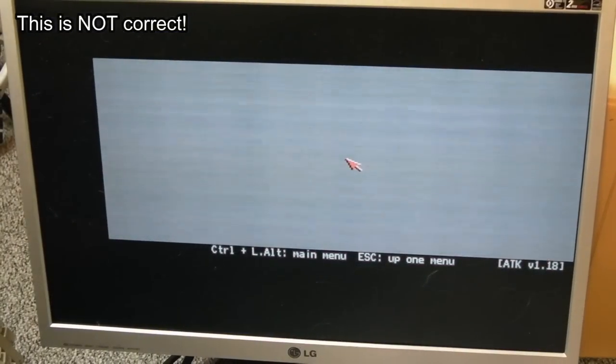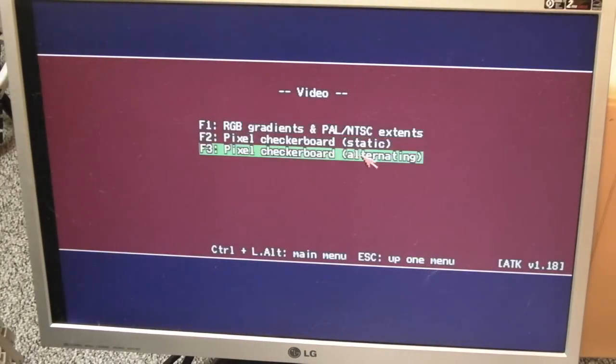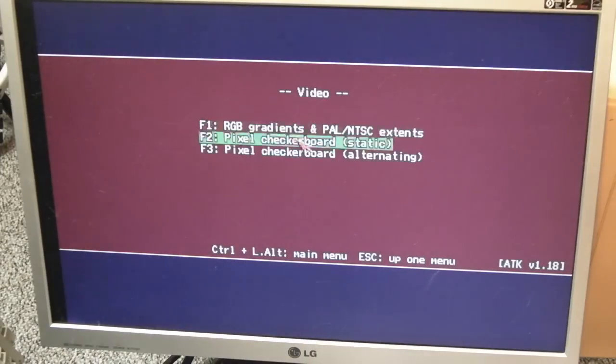But it could also be that little trim thing on the end of the board there next to the VGA connector. Let me just touch that position there with the tool. Yes, it's stabilising it. So yeah, that just needs a bit of a flush out, that variable cap.